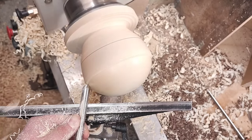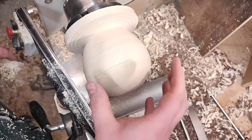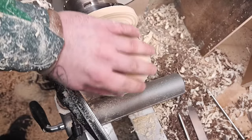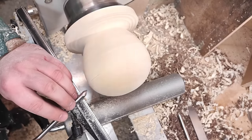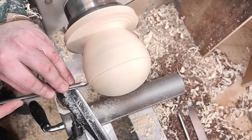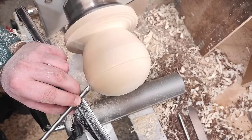Okay, that looks much better, and I'll stop here. You can see the gap here is quite bad. If I had the joiner, or if I maybe spend a little bit more time, get it perfectly flat, then it will be much better. So all of this is now sandable, but I need to address this. So what I'll do is I'll grab a spindle gouge and I'll make a V groove. Whoops, that's not what I want. So out of the mistake, make a decoration.